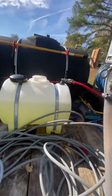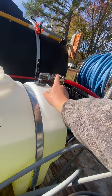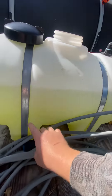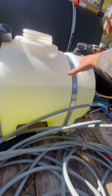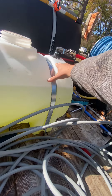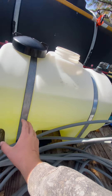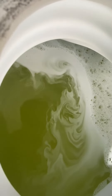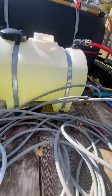Coming into the tank, I've got a bulkhead with a 90 into a cam lock fitting, with a banjo cam lock on the other side. I've got a hose barb and just a piece of half-inch hose that comes down to here. I don't have it hose clamped or anything — there's not a lot of pressure coming through — but it just lets the sodium hypochlorite go to the bottom of the tank and fill up with no bubbles or anything.